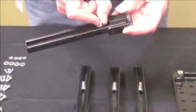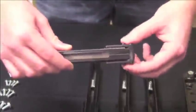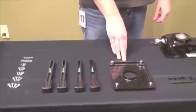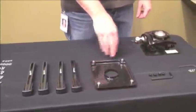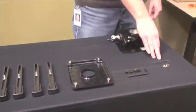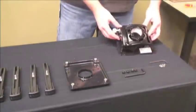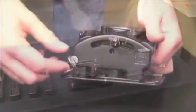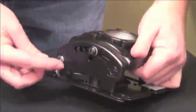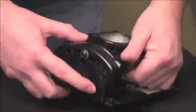Each of the mounting legs has a sliding threaded stud that can move the length of the leg for maximum adjustment. The mounting legs feature a quick connect latch with a visual lock indicator for fast, secure installation. Four thumb nuts rigidly secure the mounting legs to the mounting plate with a hex key. The SLBU also includes tamper resistant screws that provide theft deterrent by securing the quick release latch on the mounting legs. The new universal interface is included with Chief's exclusive RPA Elite projector mount.